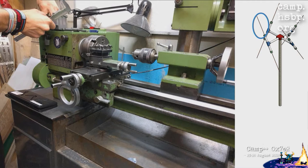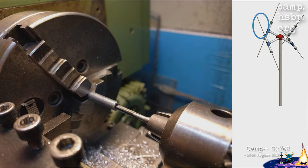I didn't know how to use it. Now I know how to use it a little, but he knows how to actually use it. Yeah, this is a lathe, and we used it to connect the wire of the antenna to the rods, which are sticking up above my head here and trying to poke out eyes. You can't solder aluminium to copper, so we used the lathe to make threads into the rods, which you can see on the picture.